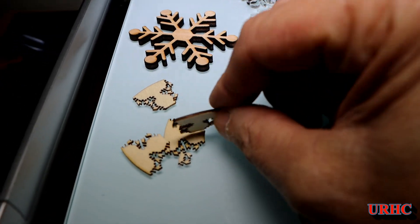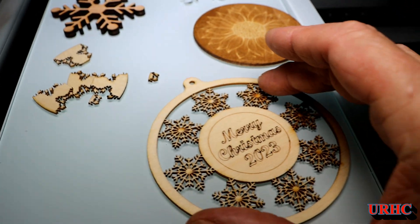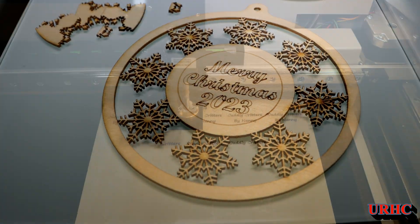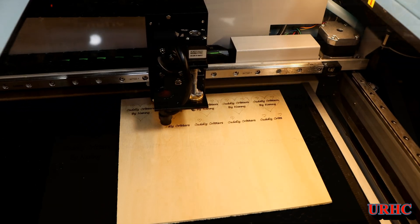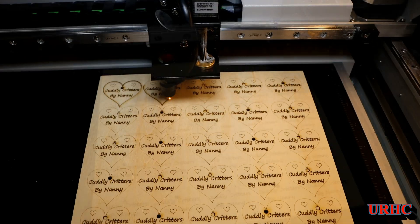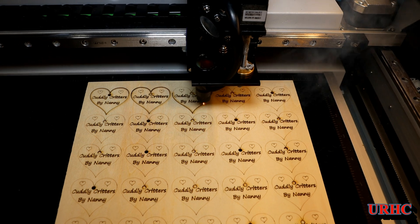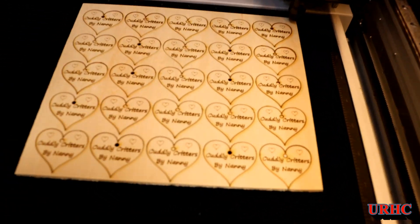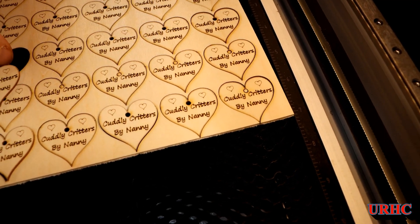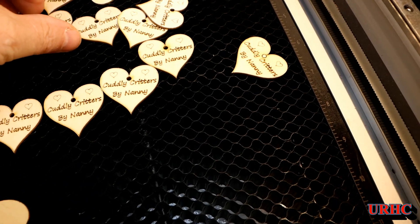You can see no real burning otherwise — just a beautiful job. It looks like it's going to be good for really fine detail work. That's some really fine artwork on the 1.5mm fiber board — you have to gently get the pieces out. Those two parts at the start won't pop out because the air assist wasn't working yet, leaving a burned area. Then my wife needed more tags for the little animals she makes to give away — I had to speed it up way over the diode settings. This does the tags in about one-third the time, and they came out beautiful.